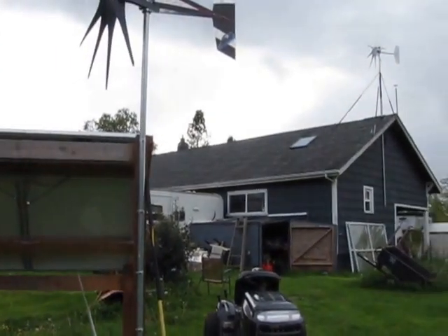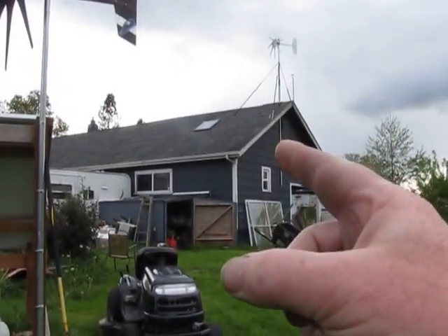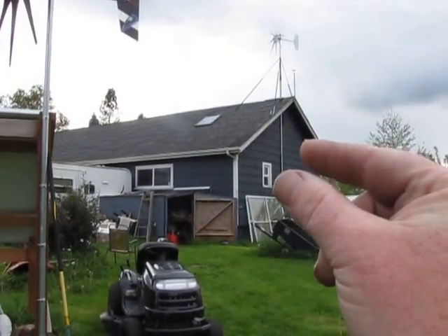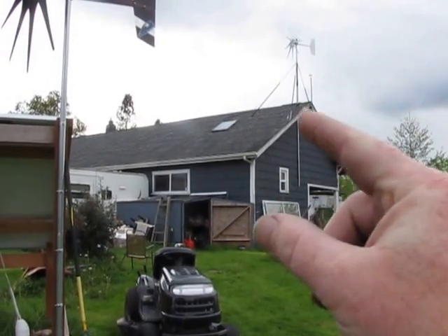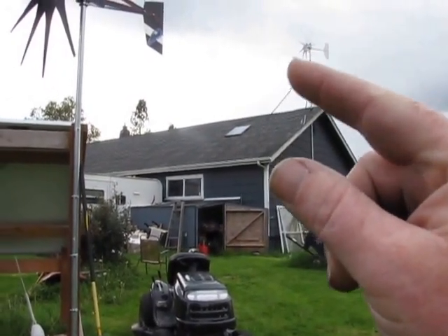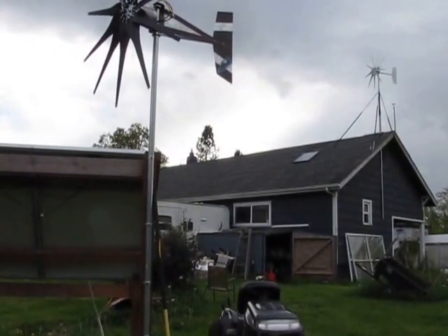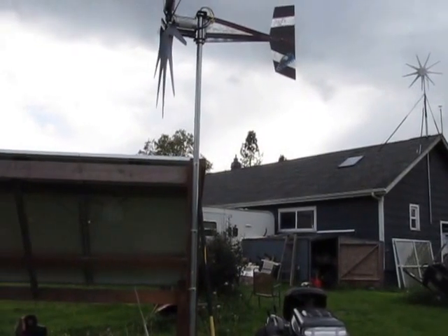What I think I'm going to do — you see that my mounting pole goes all the way up right alongside the house — where it mounts to the house, I'm going to put some rubber spacers in there, and that will quiet it down. I didn't even think of that when I put that up there. It'll help with the hum of the PMA or the PMG. And look at that low wind speed tracking — that is just awesome.